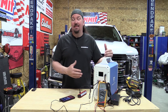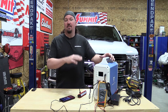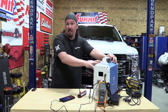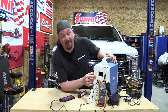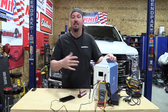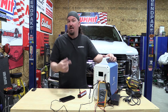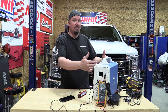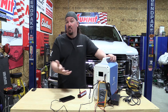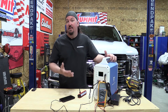The voltage looks good, and we've run this thing a long time. It took me a while to get this review up because I really wanted to put it through its paces. One big thing this unit does that some others don't: as long as the AC is on and something is plugged in the back — even if it's not drawing much power — it will stay on. We've had other units that click off after 20 minutes. Not this one. So you can hook it to your sump pump, let it go, and it will stay running. I ran it overnight and still had three-quarters of a charge.